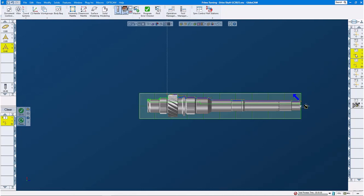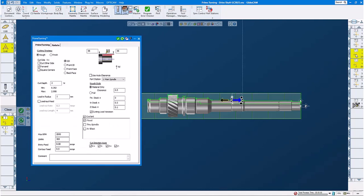Operations three and four — we are machining that small section over here. We set our machining markers again from left to right. It's going to be a roughing operation, but with a smaller depth of cut. Forward, two millimeters depth of cut, leading radius again, feeds and speeds. We'll leave a little bit of stock as well.